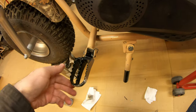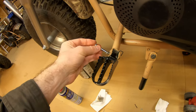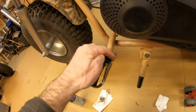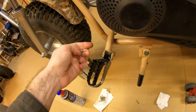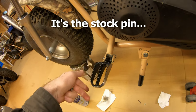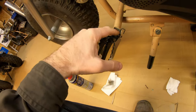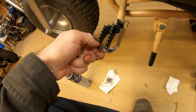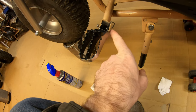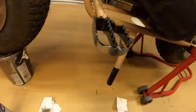The pins that come with it are way too fat to fit through the bracket. You could drill the bracket out but then you'd never get the stock ones back in. So I just tried a thinner pin and with all the spring tension it's fine. It is a bit wobbly with no spring on there, but with all that spring tension it's perfectly fine. So I'll cut that off, put a cotter pin in, and boom.